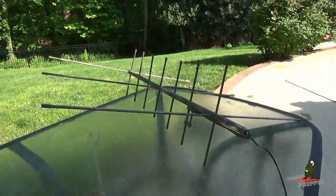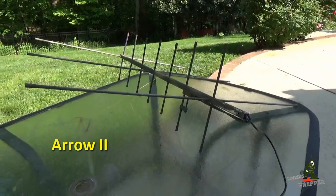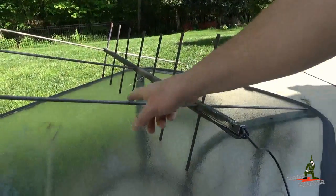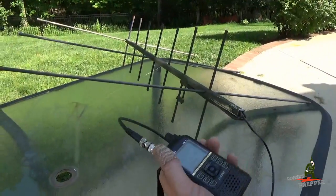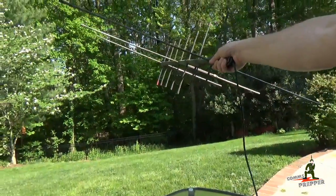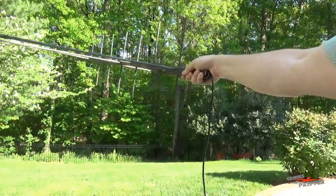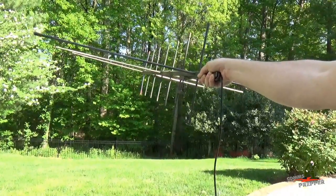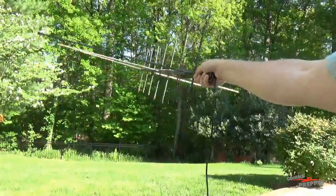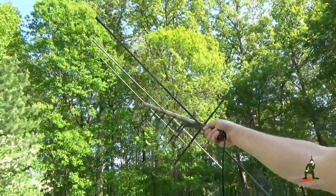Here we have the antenna — I painted it with camo paint, but it actually has purple elements. This is the Arrow 2 antenna, and I'll put links below. The longer elements are the VHF side, and the shorter elements are the UHF side. We transmit up to the satellite on UHF and listen on the downlink on VHF. When operating, you've got your volume up, one finger on the channel knob to accommodate Doppler as the satellite comes over the horizon, and you hold the antenna out with your arm using tracking software on your mobile device. As the satellite comes up, you'll hear static increase and decrease as you point the antenna at it — it's a very high gain antenna. To adjust for the satellite rolling and changing antenna orientation, you rotate your wrist; you'll hear the static come and go, and it'll walk up and get clear. You'll hear it with your ear and follow the satellite completely through its pass. That's how you work an amateur radio satellite.